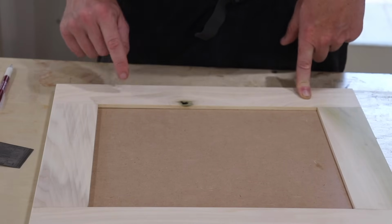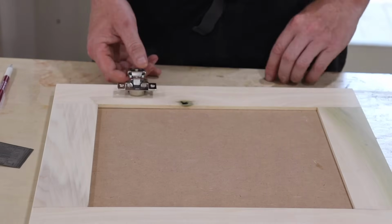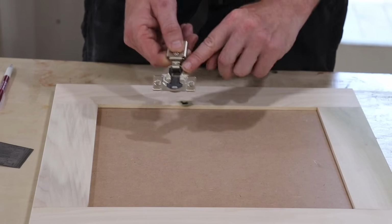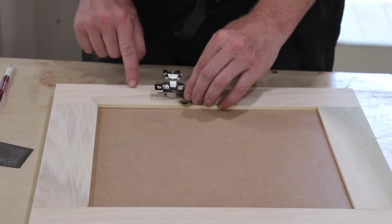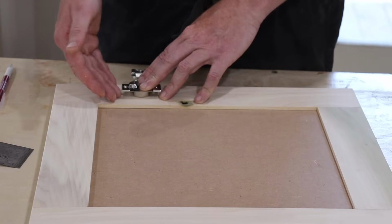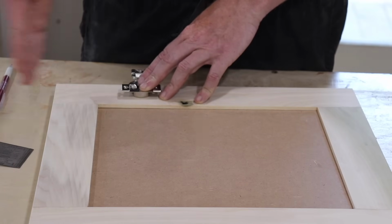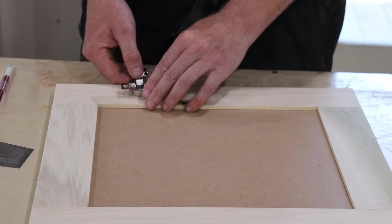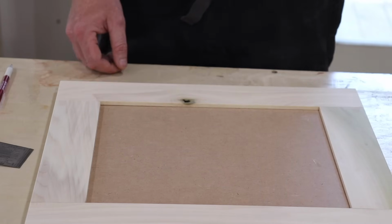And the tab is the distance from the hinge itself, meaning this bottom portion here, from this outside line to the edge of the wood. And that is gonna be very important when it comes to how much your overlay is. Overlay being however much it's sticking out over the front of the face frame, whether it's 1/8 inch, 1/4 inch, 1/2 inch, 3/4 inch. This case is gonna be 3/4 of an inch. So those are the two measurements that I'm concerned about.